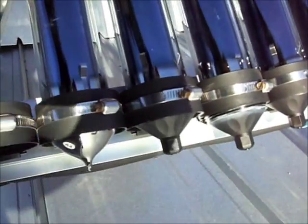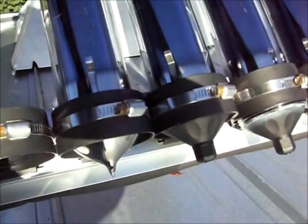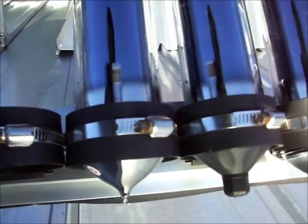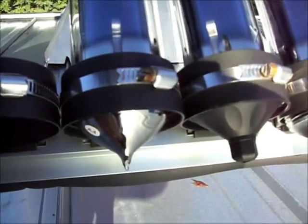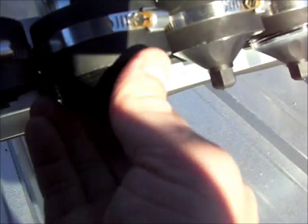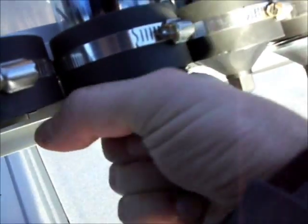You can see from the other tubes there, basically that's the finished position. They tend to slide down by themselves, so what you want to do is get that cup on there as soon as possible. Don't walk away and leave the tube by itself because it could fall off. The tube can slide through and smash the roof and pop the vacuum on the tube if you're not careful.